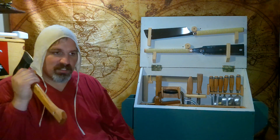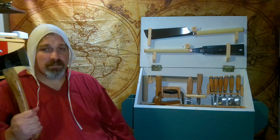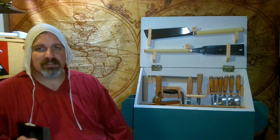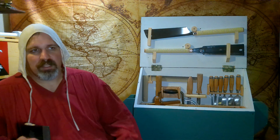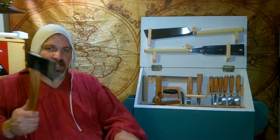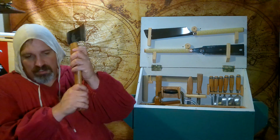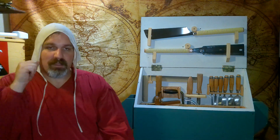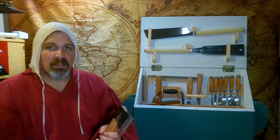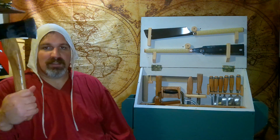This edge is actually very good at shaping. It's also very good at splitting. Like if I need to cut a board into 3 pieces, like I need three sticks for legs of something, I can take this, line it up exactly where I want the cut so it'll split the grain, and put it down. I can take my mallet or just take a chunk of wood and go BAM! Now I'm not wasting 20 minutes making 3 cuts. Smack! And it'll do it.